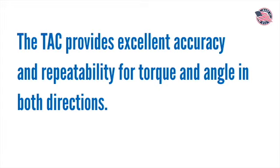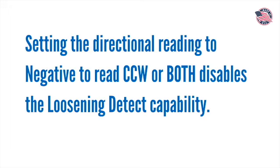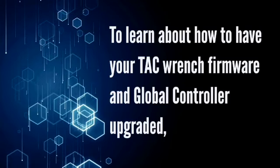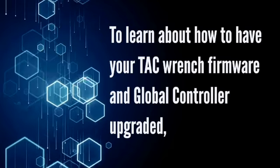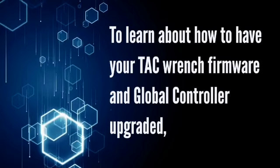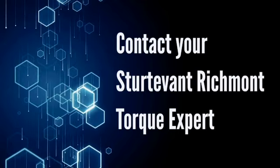The TAC wrench provides excellent accuracy and repeatability for torque and angle in both directions. One last note about the directional settings. Setting the directional reading to negative, to read counterclockwise, or setting the directional reading to both disables the capability of loosening detection. For more information about how to have these 4 new capabilities installed in your existing TAC wrenches and global controller, contact your local Sturtevant Richmont torque expert.